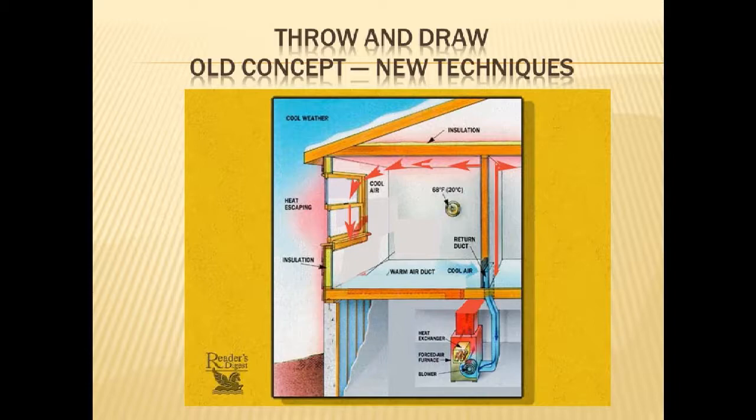And we're taking our cold air return off the floor like that. That's an easy one. And then the top, we're just shooting out, but this time we're worried more about what we call throw. Okay, and throw is how far will the air go? That's where these open grills come in.